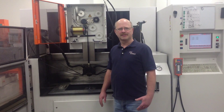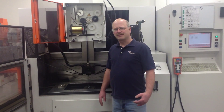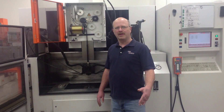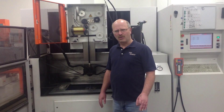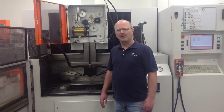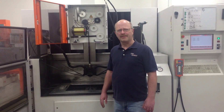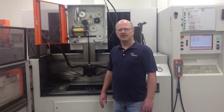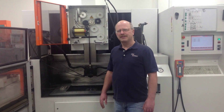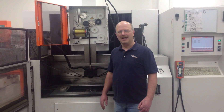As with all EDM machines there's an electrode. In this case a small brass wire is the electrode. Electricity is applied to that wire and the electric spark jumps from the wire to the workpiece as it slowly passes by the workpiece. The wire actually never touches the workpiece. In this machine right now we have 0.010" diameter wire loaded up. We're set up to use 0.006", 0.010", and 0.012" diameter wire. This machine can actually go all the way down to 0.003" diameter wire, which is about the size of a human hair. Some high-end machines on the market can actually go down to what we call 0.0008" diameter wire, or 8 ten-thousandths of an inch diameter.